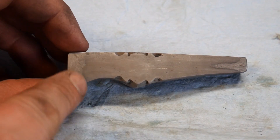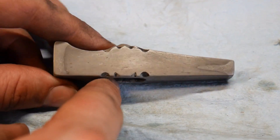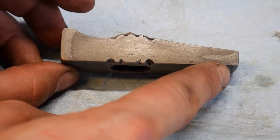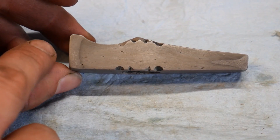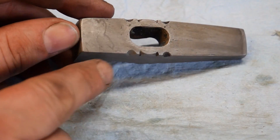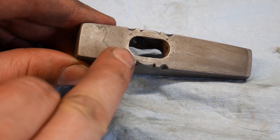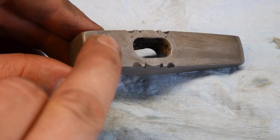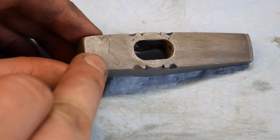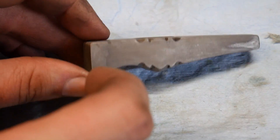You can see how this is a dissimilar steel — these are 1095 faces. This is really neat because it shows you how I welded this together. This back here was a bird's mouth weld, and then up here was just a butt weld — welding the face on flat to this piece before I did all the forming. Back here it's a little harder to distinguish because there was more wrought iron that came up over this and kind of lapped up to the edge, so technically that line still runs right down through there, but since it had a little skim of wrought iron over it, it doesn't look as pronounced as that line does there.